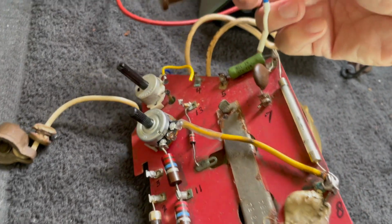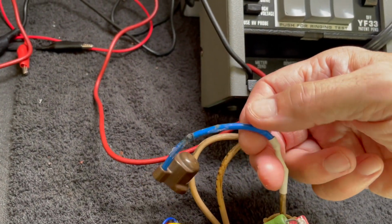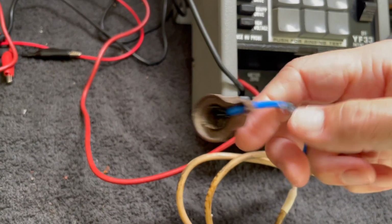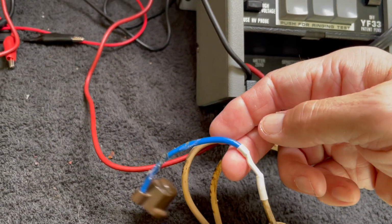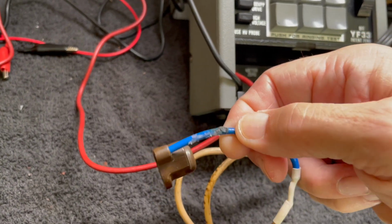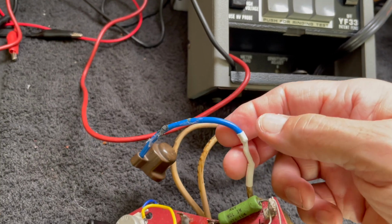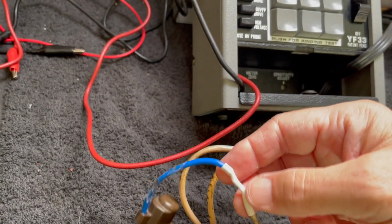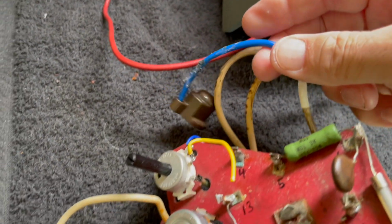And then this plate cap wire has to be redone. I thought I might be able to cut it off here and resolder this cap on it. I don't need much, but as it is here, when it broke off, it's too short, and we saw that we arced right through this insulation, so this is not the right wire really. So what I thought I might do is clip it off at a clean spot, use another layer of heat shrink, and solder this back on.